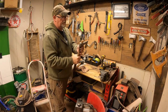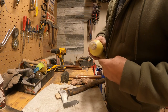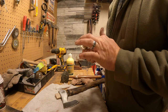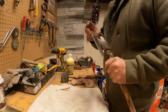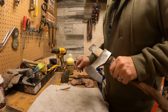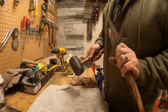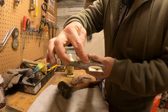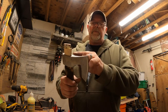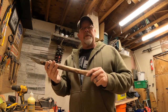It's a pretty nice fit right there. Some people glue wedges in, some people don't - I figure the glue cannot hurt. Let's put it in there. I made sure the wedge was going to be tight to the front and the back. We're gonna let this set up and dry, then cut the top off so it'll be nice and smooth. For this one, we're going to cut it right flush.